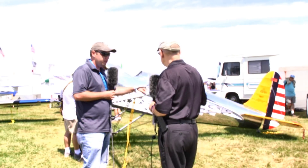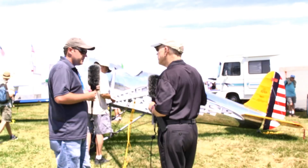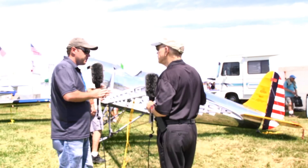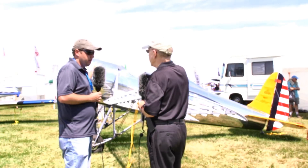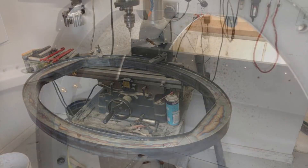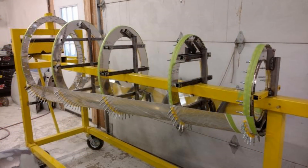This is honeycomb aluminum - a 5052 skin with 3000 series internals. It's naturally corrosion resistant. When you peel it apart, you can see they put epoxy adhesive on both panels completely and then sandwich it, so that epoxy on the inside is a natural corrosion inhibitor because it's covering everything. The backbone of the airplane is a steel ring that we manufacture in house. The wires attach to it, the strut attaches to it, and all the landing gear attaches to it. That unit is welded up fully and sent out for heat treating to relax everything. All the rest of the bulkheads are simply aluminum stampings.